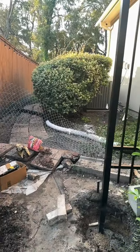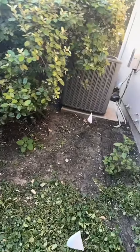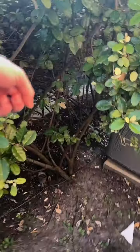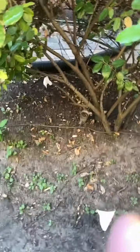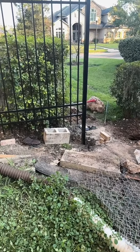Generator location is going to be right over here. They're having some work done here — this will all be done by the time we're done. Also, this bush will be trimmed back to the AC by the time we're done. We're going to do the pad three feet off the house so we can flip the generator orientation, do the back side on the front. We're going to exhaust towards the fence there. We have six feet clearance there, so we'll be fully clear, and I'll have three feet of air intake clear once we get the bush cut.